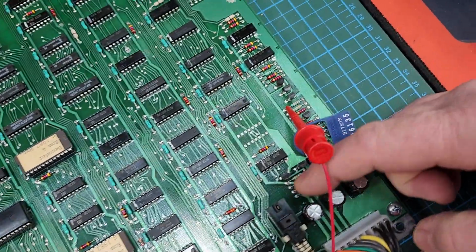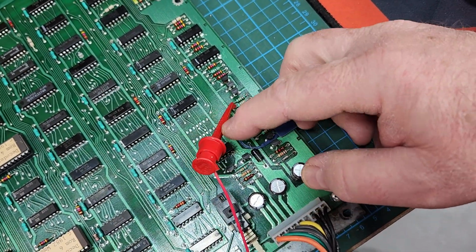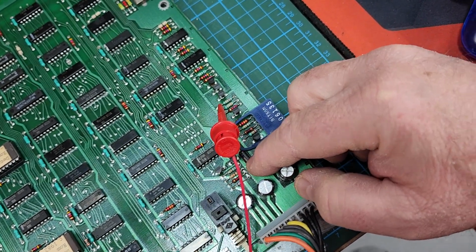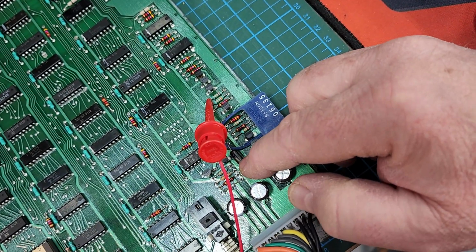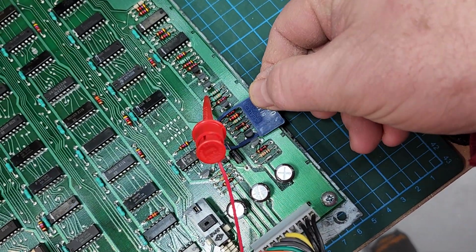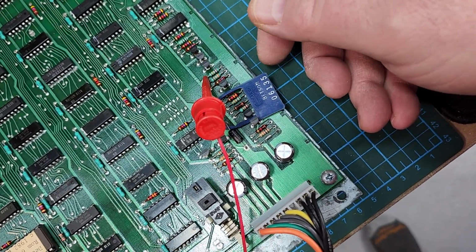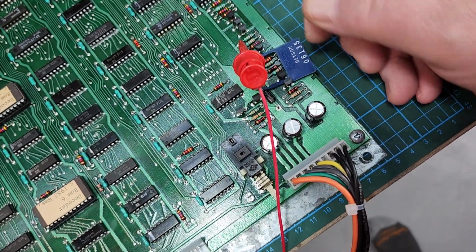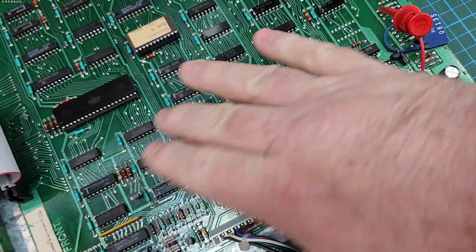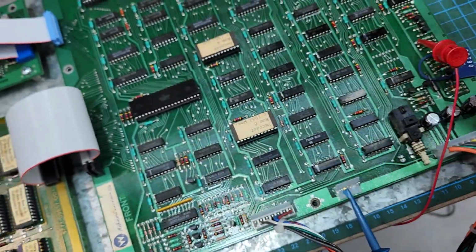We've got all new electrolytic Nichicon filter caps here for the 3 voltages coming in. There's also an aluminum electrolytic axial lead here for the soft start. I put a tantalum in. I did put back the Betson tags from previous repairs that were done. They're kind of nostalgic, I think, so I put those back on the MPU and ROM board they were on. We've got all new Molex headers with the square pins. Pulled the decoders and CPU, straightened legs, cleaned them, polished everything up.